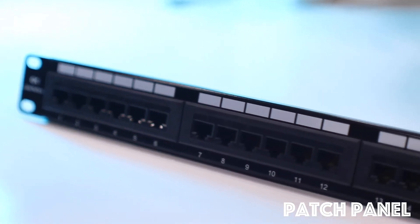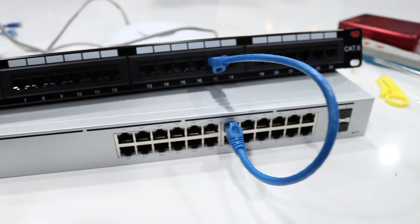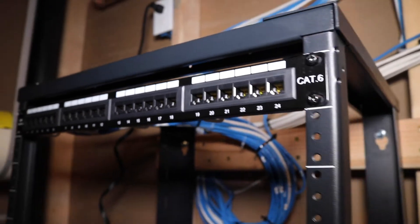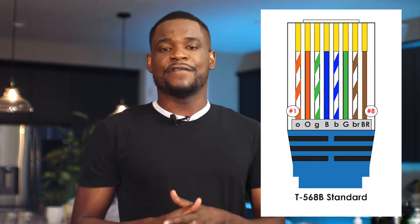The second thing I needed was a patch panel. I bought this one from Amazon — Cable Matters — and it looks good and does the job. The patch panel makes your network look very professional and also provides flexibility and scalability. Instead of connecting all cables directly into the switch, you connect them to the patch panel, then patch the front as needed. For example, I allocated the first few ports to cameras and the next four to APs. For ethernet wiring, I used T568B, which is very common on regular networks — T568A is mostly used for government or federal contracts.